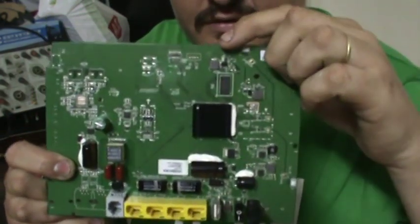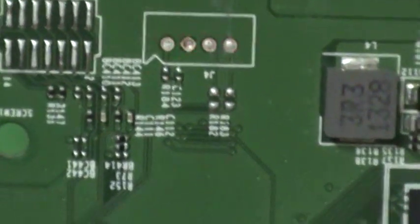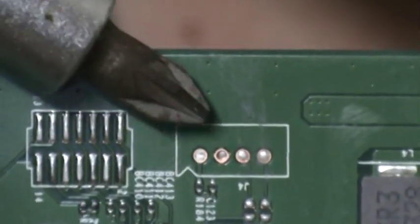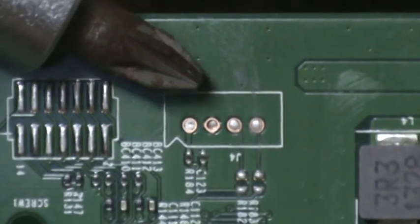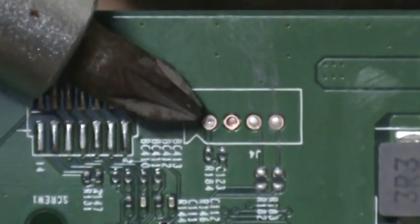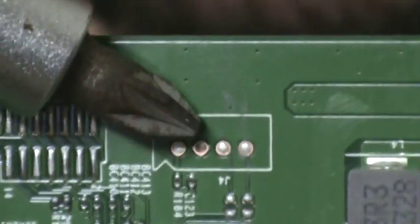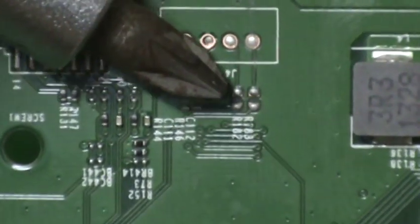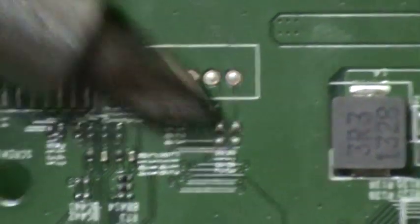We are interested in the serial interface, which is up over here — the UART. That's that 4-pin connector that you can see over there. That'll probably be a supply voltage over there; that one is grounded to the ground plane, so that'll be your ground pin. And you've got two data pins. But you can see those data pins are missing resistors linking them to the processor.